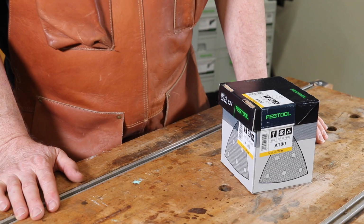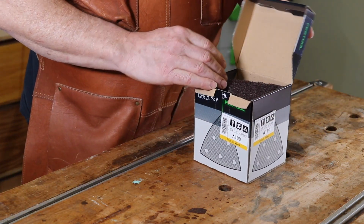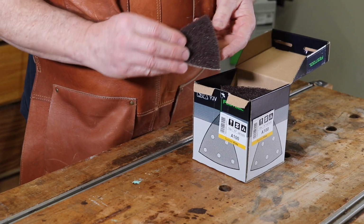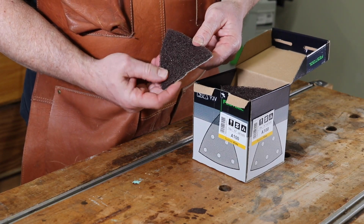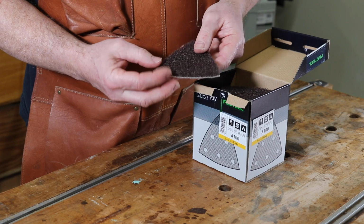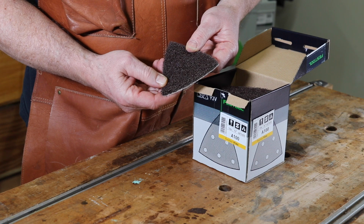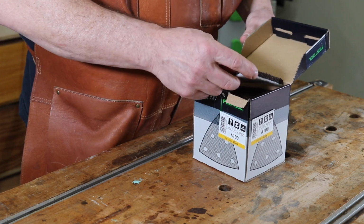Fleece is a non-woven abrasive pad like Scotch-Brite, consisting of an elastic fiber mat material with aluminum oxide and silicon carbide abrasives. It can be used to clean metal or for rust removal, and for scuffing surfaces for repainting or burnishing a matte finish into metals and cured paint.